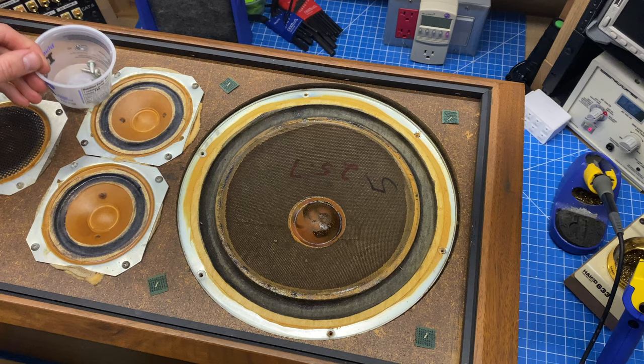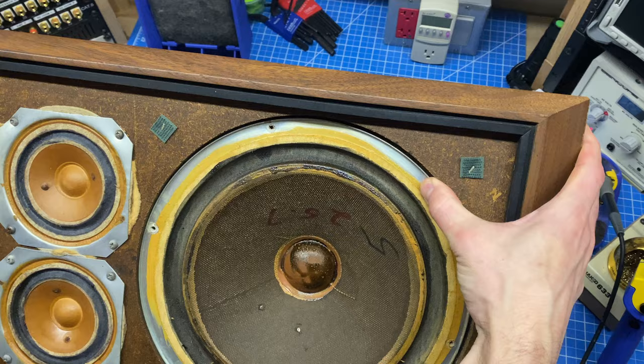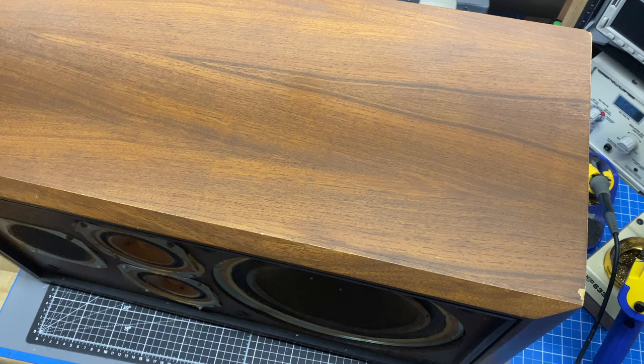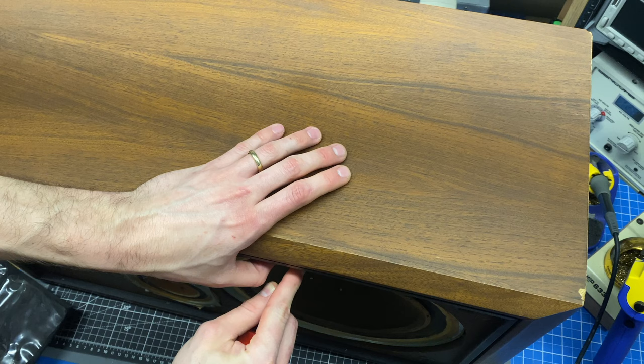Okay, all the screws are out. Now, sometimes you can use a pick tool and kind of grab the driver and get it out, but I'm just going to try to dump it out here. See if that works. There is a little bit of a gasket in here, so I'm probably not going to be able to do that. I'm just going to grab a pick tool and try that. So what I'm going to try to do here is break the seal with a pick and then let gravity do the rest. So I'm just going to be using a 90-degree pick tool here, and I'm just going to get inside of one of the holes from the screws